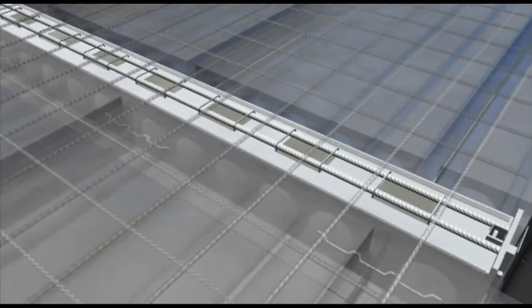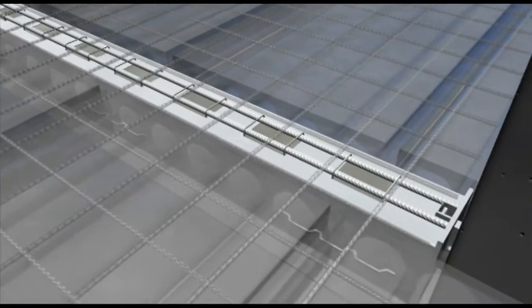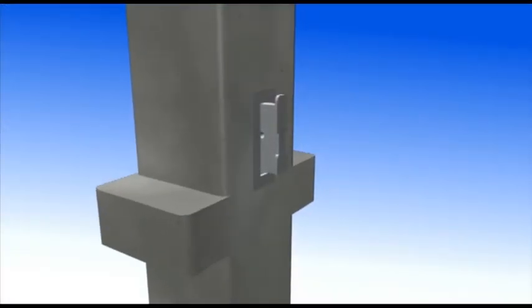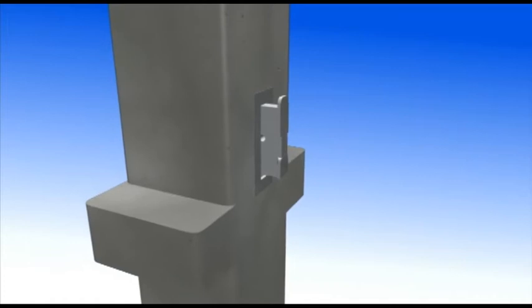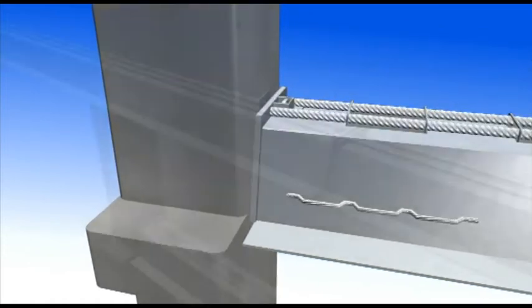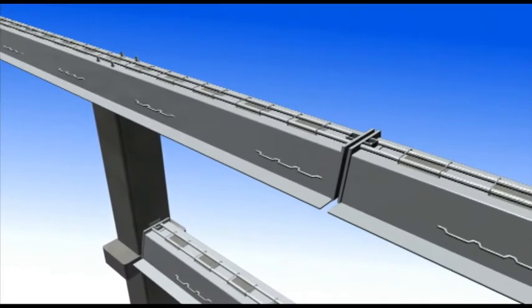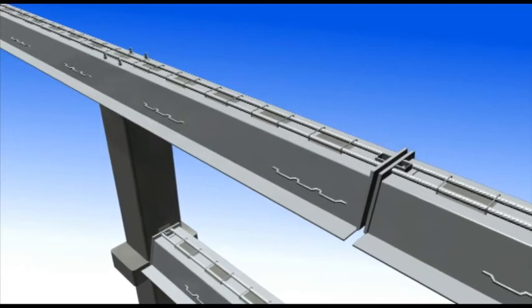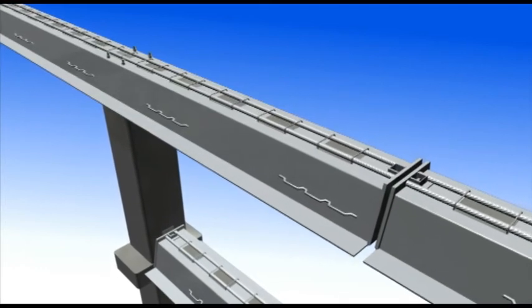The columns can be made several stories high, with the A-beam having a single span and being joined to the column with the hidden AEP steel bracket. The A-beam can also be manufactured as a continuous Gerber beam going through the column line. The beam support is then situated in the span and the columns are one storey high.